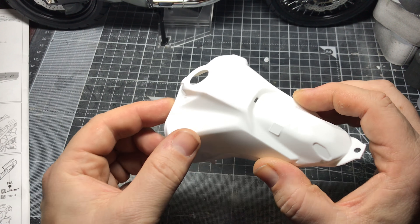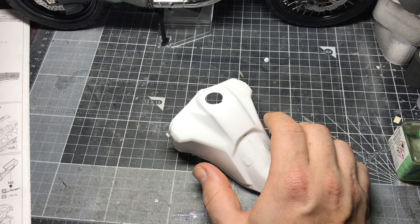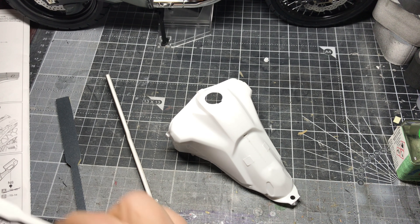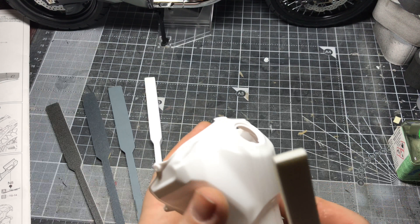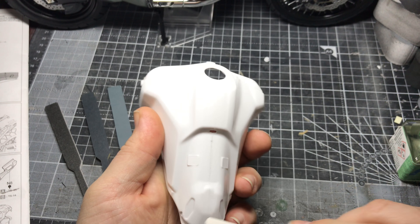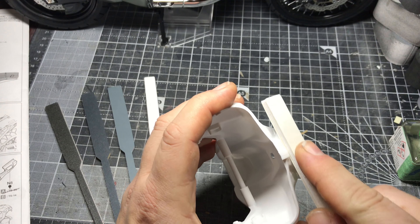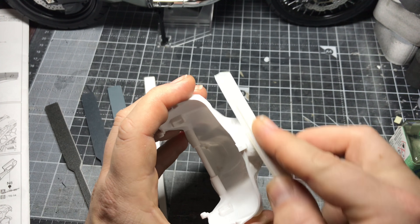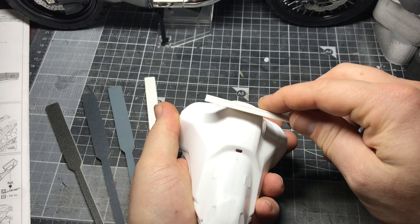All of this - I don't know how well that's coming out on the camera, but there is a definite visible seam line across there. I'm going to be using some sanding sticks of various different thicknesses and grits, which I've worked my way down through them to a finer polishing. I can actually feel a ridge across there as well. I'm using a thin one that I can use a very thin end to get into some of the finer details. Starting off with a thicker one and keeping everything moving so I'm not going to end up with flat spots.